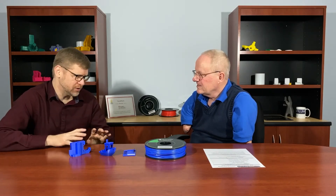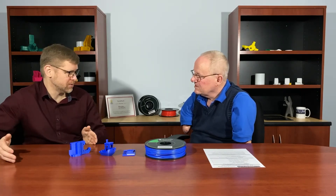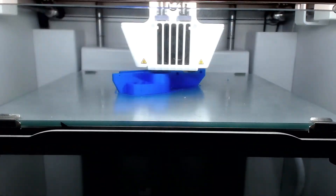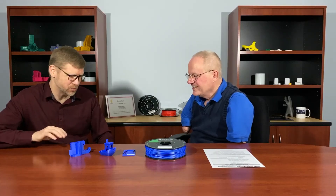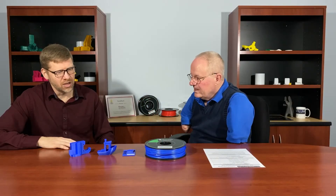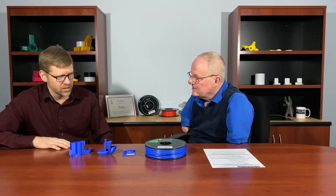So it seems like this material has a little bit of a higher temperature range in terms of printing. We did a lot of testing to see what works best. We found that a range of anywhere from 245 degrees up to 260 degrees Celsius worked well. We ended up with a bed temperature of about 60 degrees Celsius, very similar to what we would do with a PLA. We were using about a 20% fan speed. I used Magigoo — the original formulation — which gave us really good bed adhesion. We didn't need to use any kind of brim or raft. They just stick really nicely to the glass with the Magigoo and release very easily once the bed cools. We used a lower fan speed of about 20% because of the TPU component — a bit less fan than we would for a standard PLA — and that gave us really nice print results.